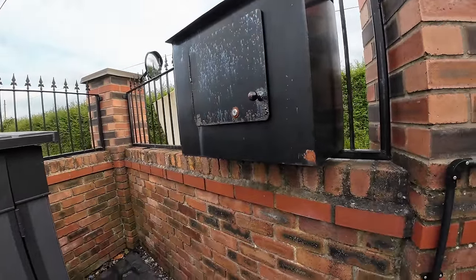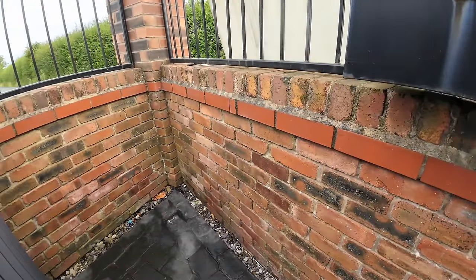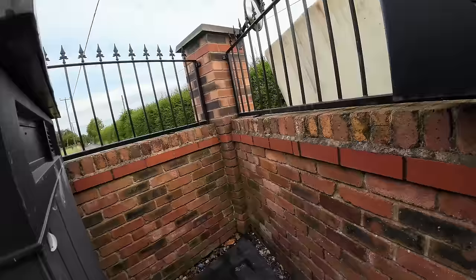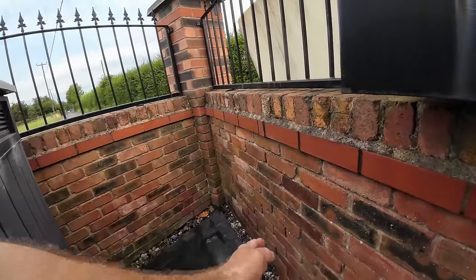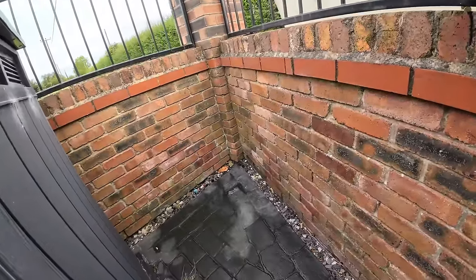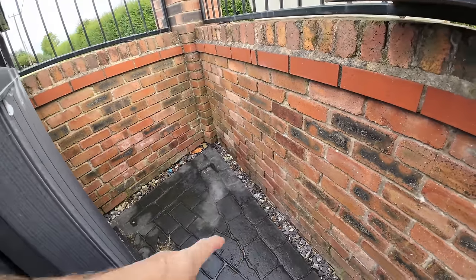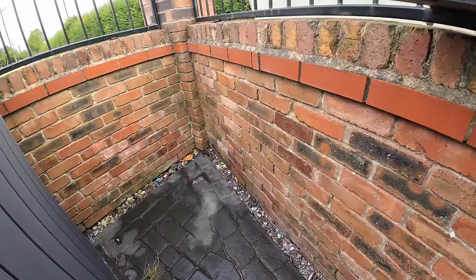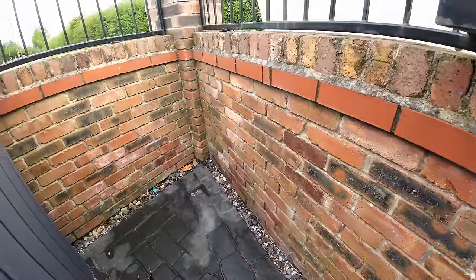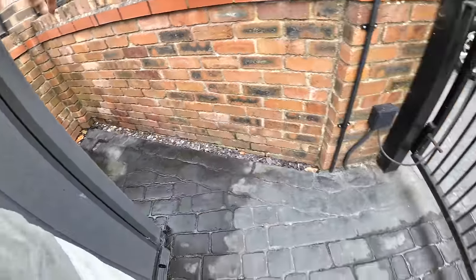So that's our job for the next 3 days. Once we get it down, we're going to see what it's like. We might just bring the wall. Most of it's going to be on the original wall anyway, and it's going to come across onto here. So we're going to have a look. I think we did talk about it and said this concrete floor is probably adequate to take that little bit of wall. The pillar's getting a new foundation, but I don't think we need to bother with the wall. And then we'll have to get the patterned concrete repatched.